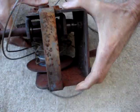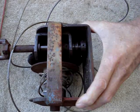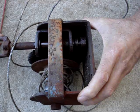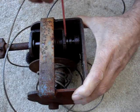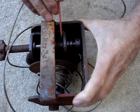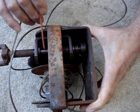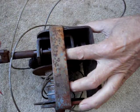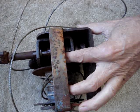The worm is too far out of center — you want the worm to stay in the center of the bull gear. I need a thrust bearing; it could be solid brass, or a ball thrust type like in a scissor jack. Another one on the other side to make sure the worm stays in the center of the gear no matter what — whether you're paying out or lifting.